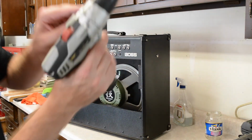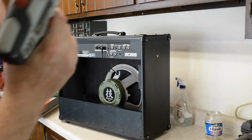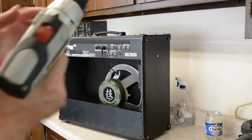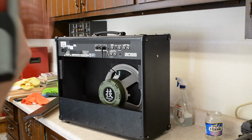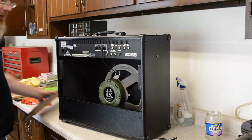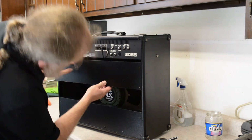By torque feature, I mean you can adjust the torque. Self-evident, but when it's on drill, you're fighting the full power of the motor. But as you turn the number smaller, you can grab the chuck. It's not spinning and the clutch is letting the bit slip. So set it to the lowest setting. Let's see. Yeah, see, that's just smart.